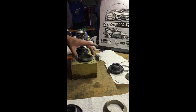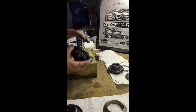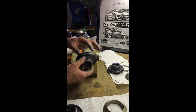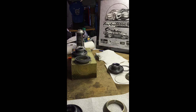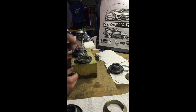I'm going to go over to the parts washer and clean these three pieces up. There's a rubber o-ring I don't want to take off because I risk breaking it, and since it's a Saturday afternoon I've got nowhere to get another one, so I'll clean that one by hand. These three pieces I'm going to put in the parts washer with mineral spirits to get the grease off super clean, and then we'll come back and talk about greasing and how to put this all back together.